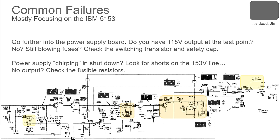So you may have something failed where the high voltage is going too high, and then it's going into shutdown and it just keeps doing that. Okay, because the LED on the front comes on, so I know power in some respect is good. So that makes a lot of sense that it might be more of a high voltage problem. Is the LED flickering on and off too? No, it stays solid. Then I would suspect it's going to be a high voltage shutdown issue.